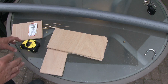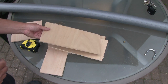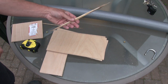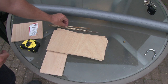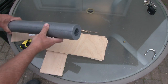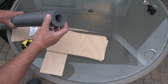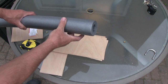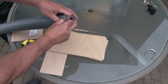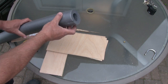So I'll just cover the form we're going to use to make the rocket stove. I've found a piece of 9mm plywood, cut that up already — I'll go through dimensions in a minute. I'm going to be using some basic barbecue skewers, about four of those. I'm going to be using pipe insulation to create the cavity inside the rocket stove form. The outside diameter of this pipe insulation is 70mm, which you probably won't find in a DIY store. So if you go this route, buy domestic pipe insulation and wrap extra pieces around the outside, roughly gluing them in place until you get to about 70mm outside diameter.